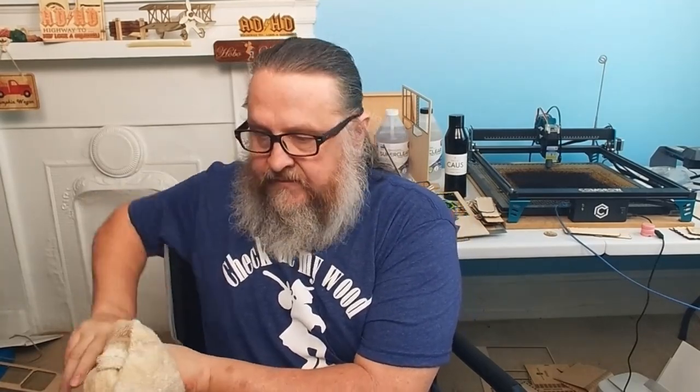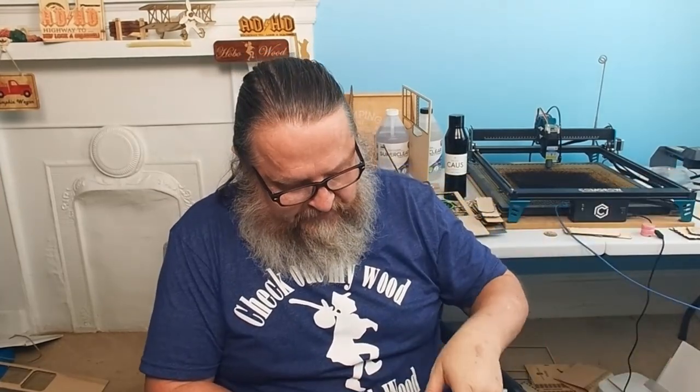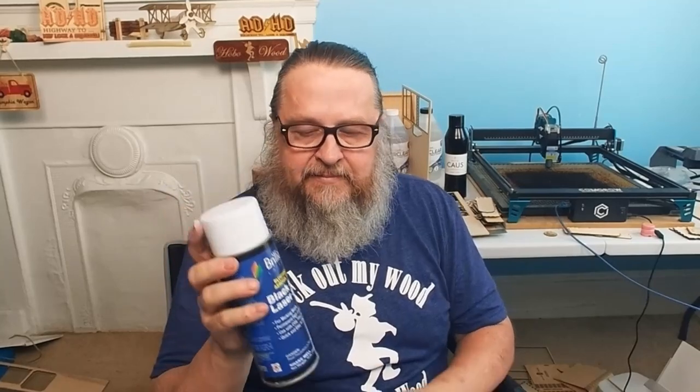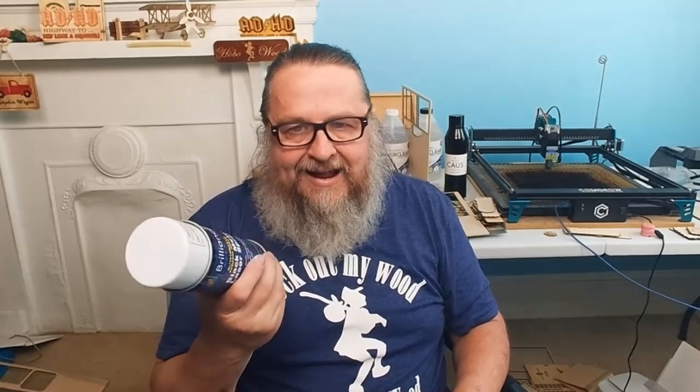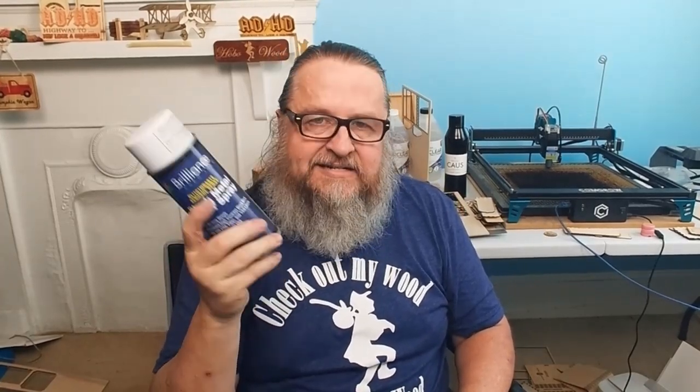That is the secret sauce in the white spray paint. That's the secret sauce in most of the coatings that you put on whenever you're trying to make a permanent mark on metals. It's titanium dioxide. It does not say anywhere on this can titanium dioxide. It doesn't say it in the ingredients or the listings. In fact, I don't even think they list ingredients on here because it's proprietary. But having sprayed this, I'm relatively sure that yes, the secret sauce in this is also titanium dioxide.